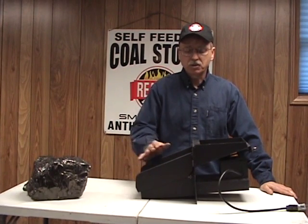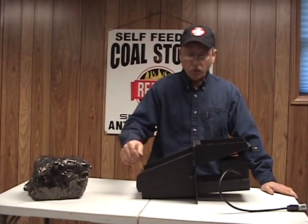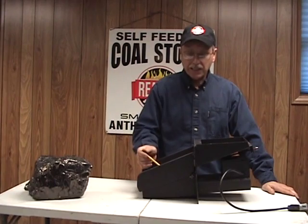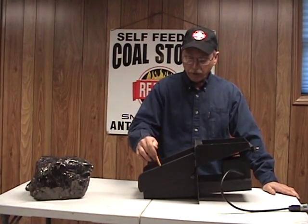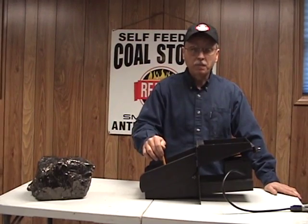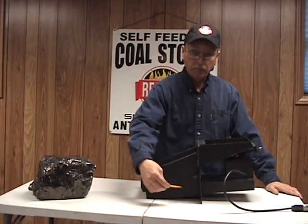Now, on the automatic units, and this is, of course, the Reading unit here. You have your cast iron burner with your air holes. One of the things that happens is you have fly ash and fine coal falling down through these air holes that are accumulating down in your air chamber.